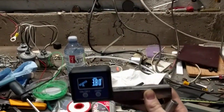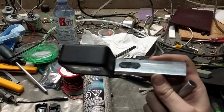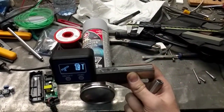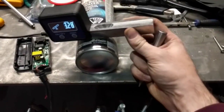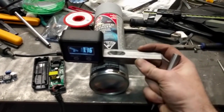I made this little tool from a mill — just a piece of steel with a hole drilled almost all the way through. What this does is it allows you to mount one of these magnetic angle finders and find an angle tangent to pretty much any point on a curve.